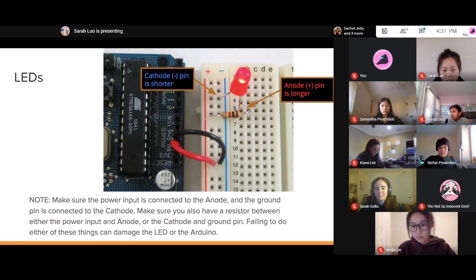Why you're not fitting into the breadboard? Yeah, sometimes it's a bit stubborn too. It'll take a bit of time to go in. It's stubborn to just go in there. Try connecting it to a different rail. Try using a different rail if it takes a while to go in, because a new breadboard tends to not want the wires and whatnot to go in sometimes.